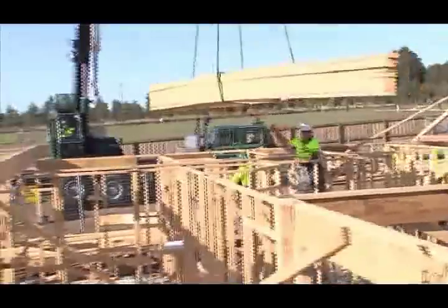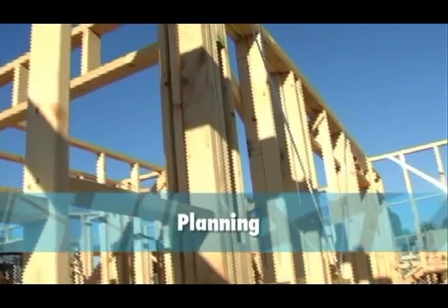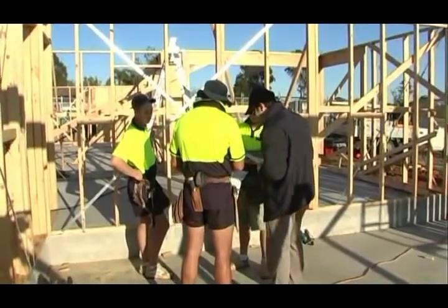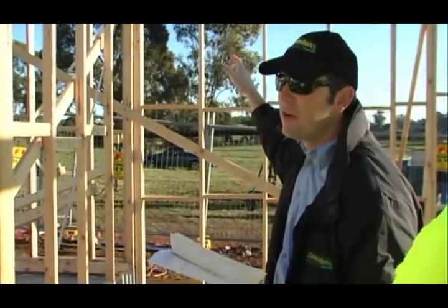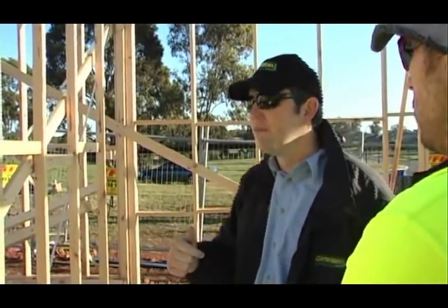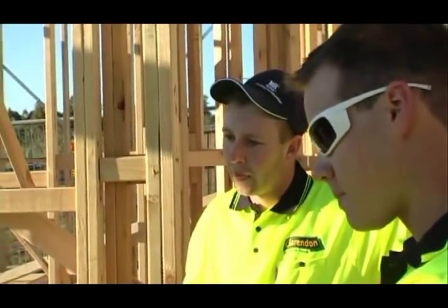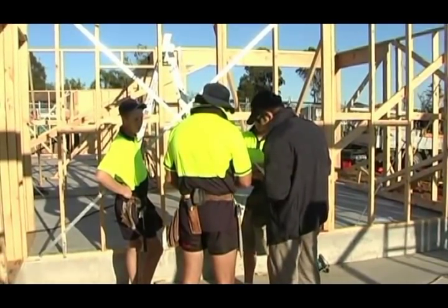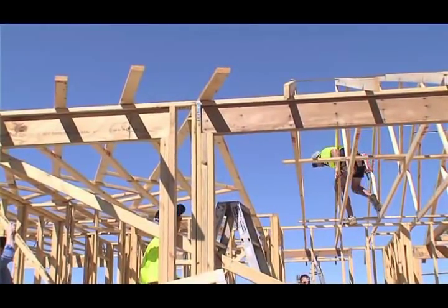If we really want to make sure we safely erect trusses, we have to go back in time. Like most important issues in construction, success ultimately comes down to planning. A critical part of planning is communication — you have to consult properly to construct properly. The principal contractor should consult with the people erecting the trusses to ensure that work is planned and scheduled to minimise disruptions and situations that could affect safety. I've been building for 34 years and never had a fall from a roof because I plan things, make sure I can't fall and make sure there is nothing underneath me if I do fall.